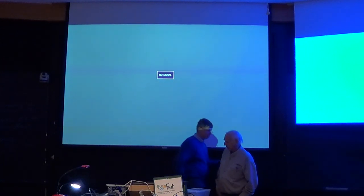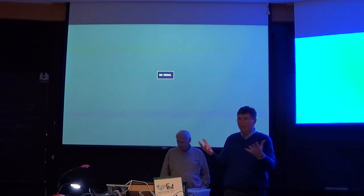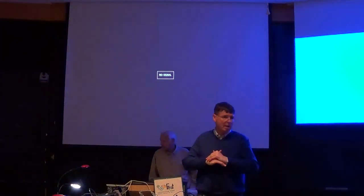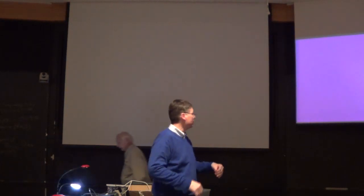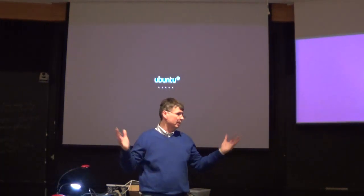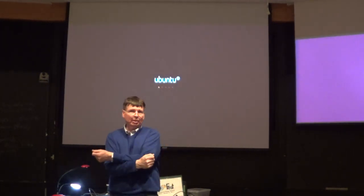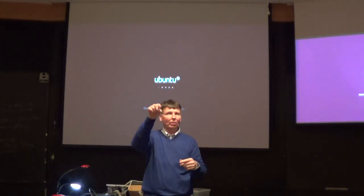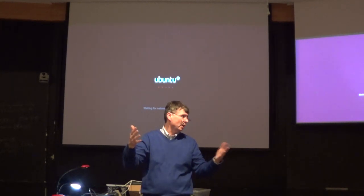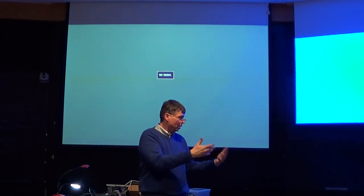In terms of the calibration, and this is something I definitely haven't done, as you're engineering this kind of stuff, you've got to figure out what they typically spit out, numbers in a range of 0 to 128, or 0 or 1. In the case of this button, I don't know if I put the red and the black opposite, or if it's just the way the button works, normally open and normally closed. But the way the button boots up, it boots up with a 1, showing me that the value is high.